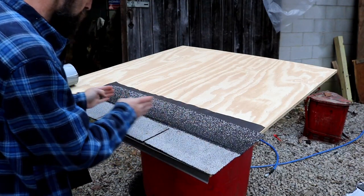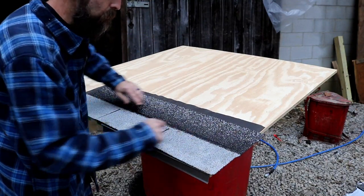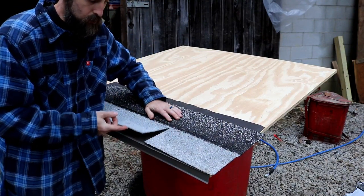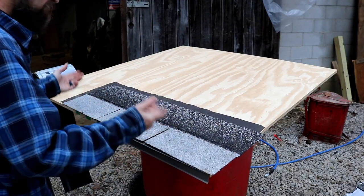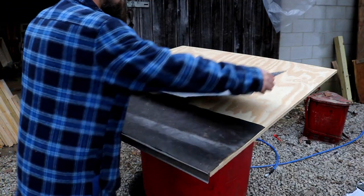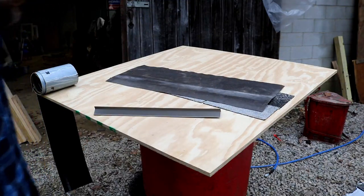And then your shingles are just staggered from that point on, and every row above this has that sticky layer that holds down the ends of the shingles. And your nails are staggered where they're not shown. So that's pretty much it, really. A real basic description, but that's the way it's laid out.